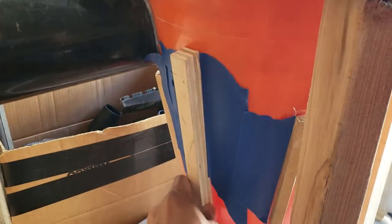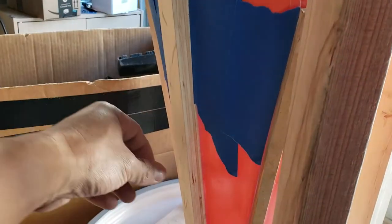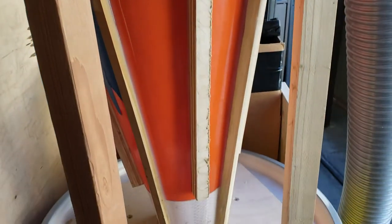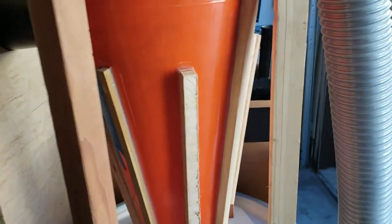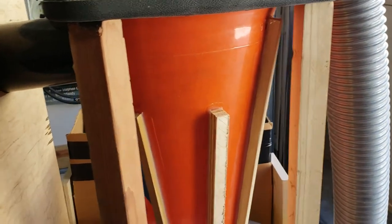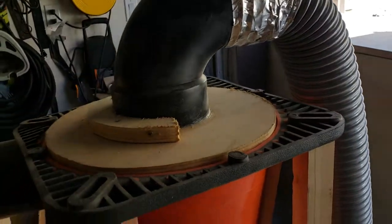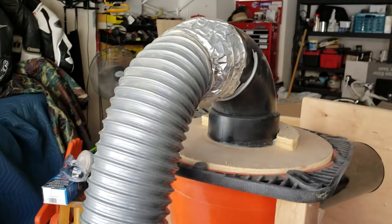You may wonder what these ribs are. With the negative pressure, I noticed the cone was getting sucked in, so I took some scrap plywood and used the same construction adhesive that works on polypropylene and pressed these ribs onto the cone. They're not all plywood — some are particle board — and they're all different lengths, but as long as they go most of the way down the height of the cone it works. Now the cone is pretty rigid and doesn't suck in under negative pressure, which was causing dust to get sucked up into the exhaust.